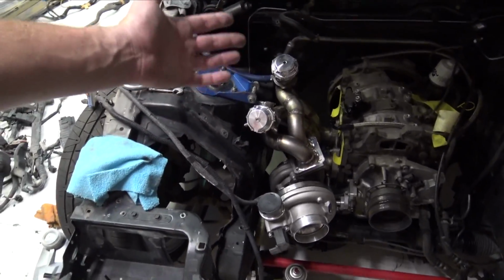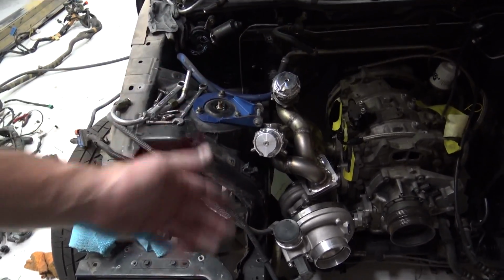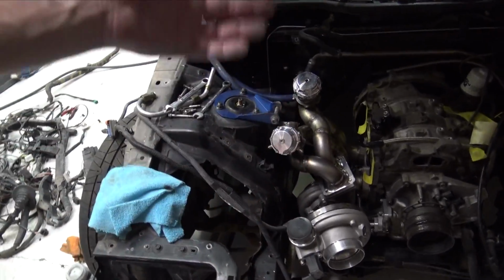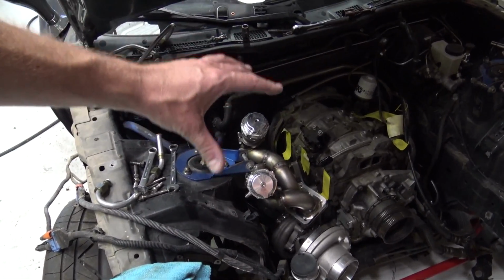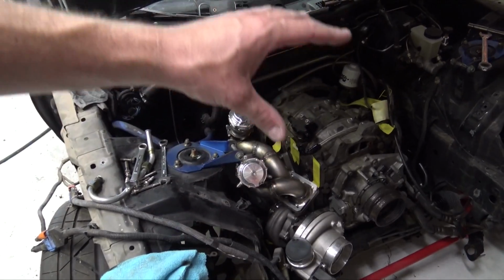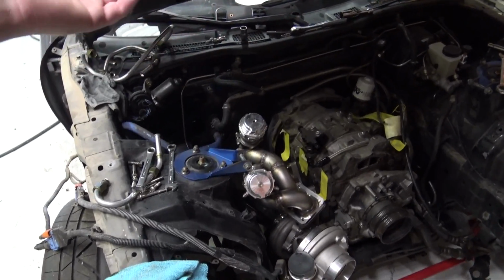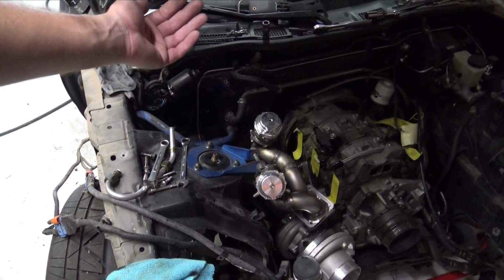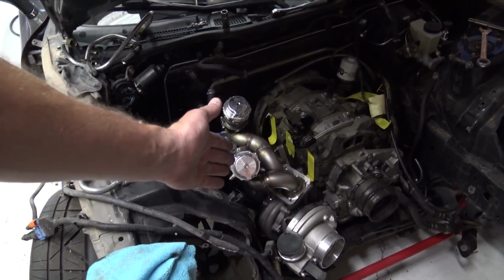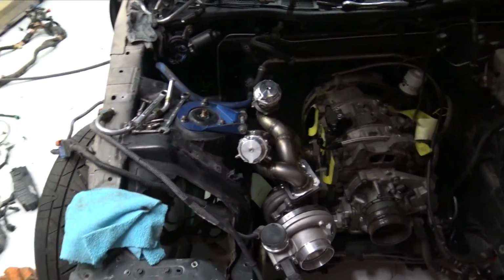And I just really like the design of my exhaust manifold because there wasn't another bottom mount manifold like this. The reason I ended up making this manifold how it is, and where the turbo sits, is that the manifold is equal length. The turbo sits down low, which lowers the center of gravity. There isn't so much weight on top up here, which really doesn't matter, rotaries are pretty light. But then instead of having a 90-degree bend directly off your downpipe, you have really not any bends. I'm going to use a lot of pie cuts. There's all my pie cuts right there. I have my own flange that I designed for the 9180 EFR, and it's just coming together.